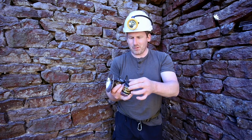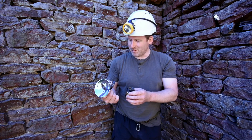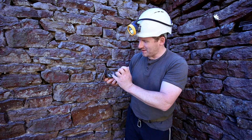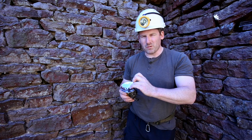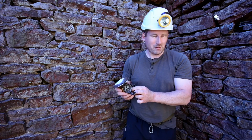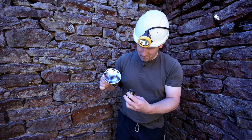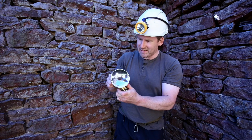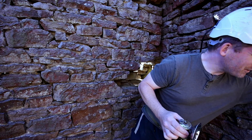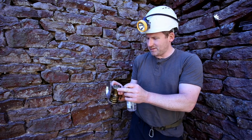I've put an O-ring seal on the top as well because I'm sure we were losing acetylene out the top. We've also cut up a bit of filter off a hoover to shove in there, because you get a sort of gunge from the carbide that blocks up the nozzle. I've put in maybe a good tablespoon full of carbide — screw it together, and in theory all I've got to do is add the water and we should start making acetylene.